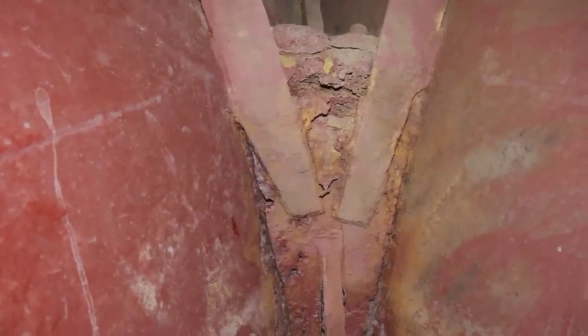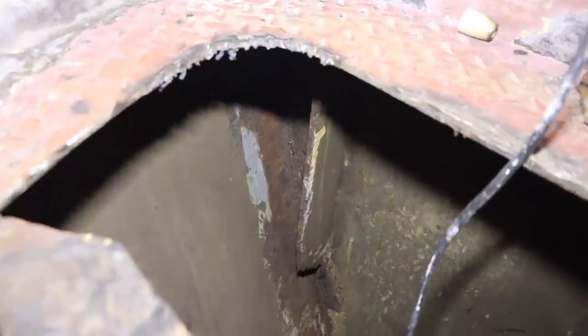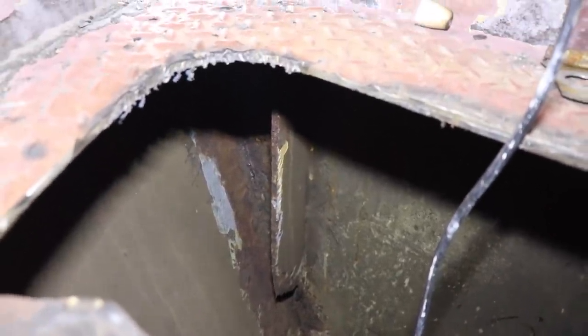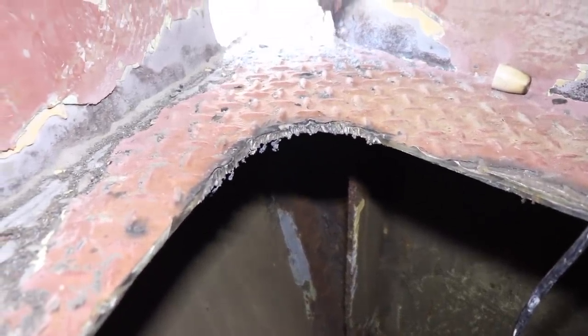And just understand what we're working with, really. So we need to gain some working space around this rusty bit of rubbish that we need to repair. You can see that vertical piece right in the center of the screen there. That's welded onto the back bulkhead. What we're going to do is plasma that out. It's not critical that that's there.